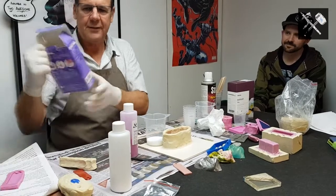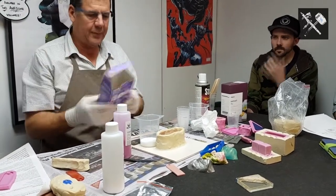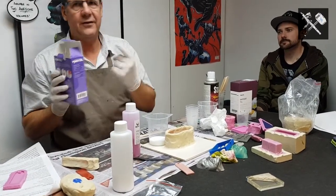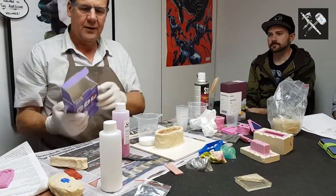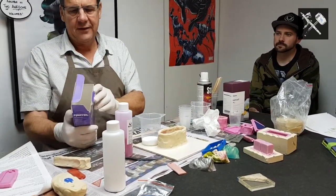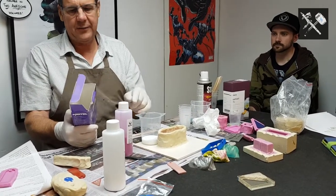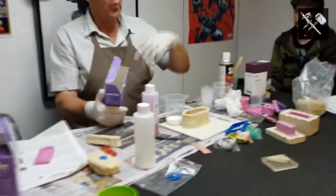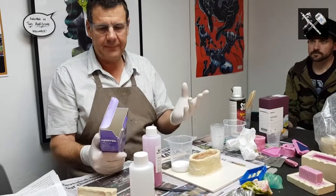Very simply, the manufacturer spends hundreds of thousands of dollars, millions, developing these products. They give you all the info here. You don't redesign the wheel, reinvent the wheel, okay? Stick to what the manufacturer says. Equal parts by volume or by weight. Pot life, 6 minutes at, tells us here, 23 degrees. Warmer, we know we've got less than 6 minutes. Colder, we will get longer, okay?